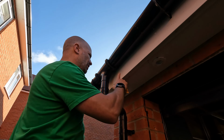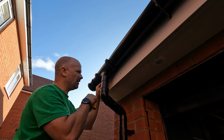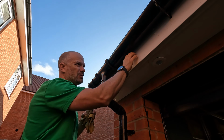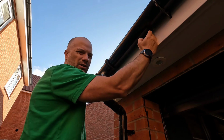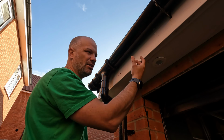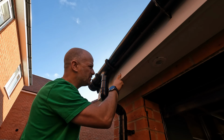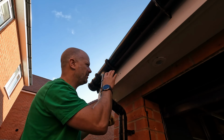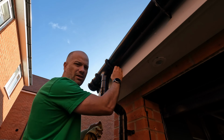Right, so the first obstacle we come up against is that the timber that we were talking about inside is actually here, and when you put the camera here, it fouls on this downpipe. So we're moving it over to here, but this was all plastic until we got to this point where there's another timber, which obviously we want a solid fixing for the camera, because otherwise it might droop at some point, because this is just PVC plastic, so you screw into that and the screws eat through the plastic. So what I've had to do is put a bit of timber inside, as you can see there's 2 screws here, so that means we get a nice solid fixing for the camera base plate, so it's going to be nice and sturdy and not going to go anywhere.